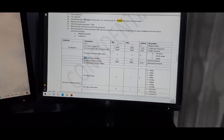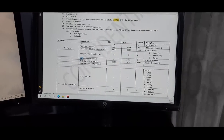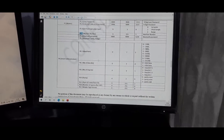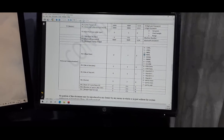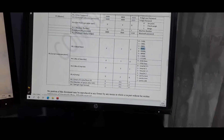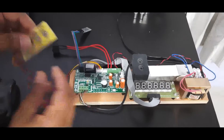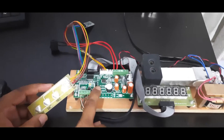P5.5 and P5.6 are optional parameters if you don't want to change the name and password. However, the most important setting is the baud rate. The HC05 works on 9600 baud rate, so you must configure the SSRT baud rate to 9600 as well. Go to menu P6.1 and set the value to 3, which corresponds to 9600 baud rate. Before entering menus, make sure the calibration switch is shorted by a jumper.